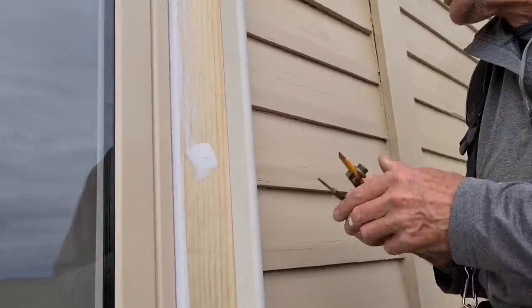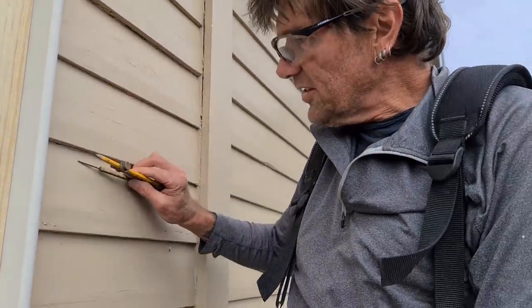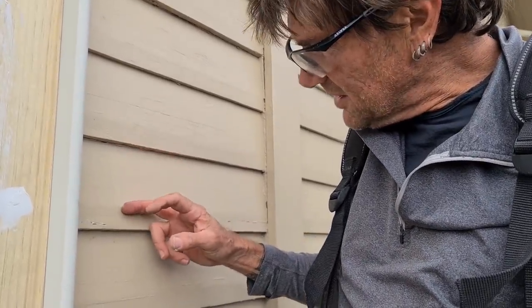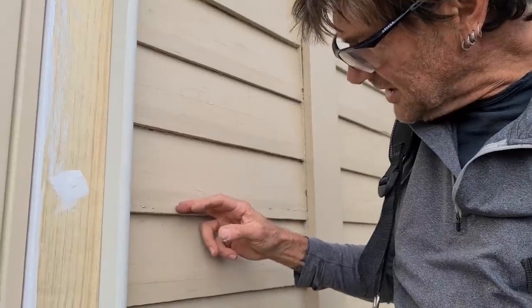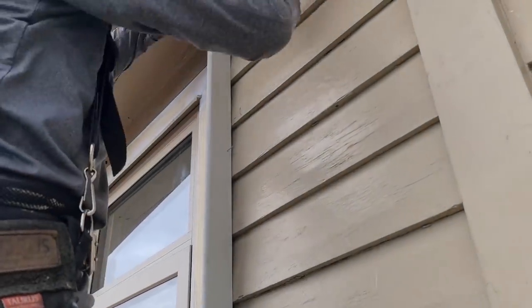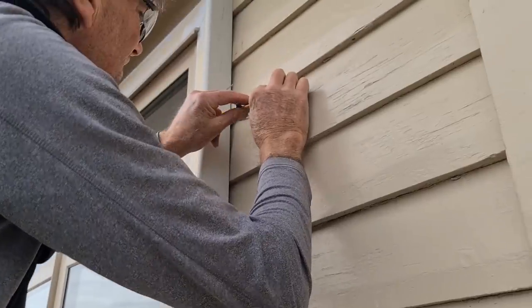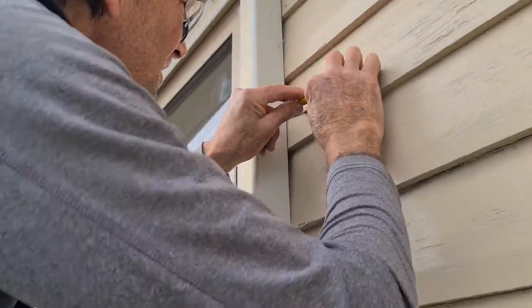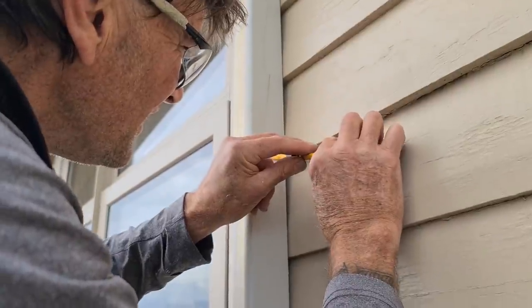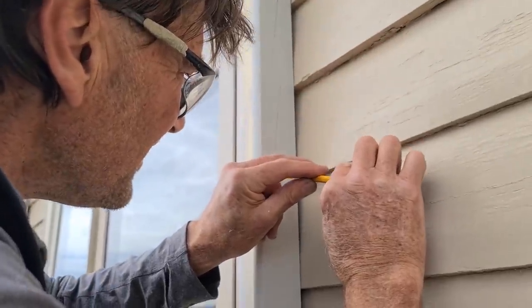I have to do this, and it's kind of interesting. You move around the other side and I'll swap sides with you. You might want to see this on the back side as well, but I can't just copy this like this. It doesn't work. So with this, all I'm going to get is this shape here. I'm going to get this down to here. Right. That's what I'll do first. So then what I do, I have to keep it level the whole time. I'm only trying to get this mating shape here. Okay. I've never seen a compass used like that, bro. That's great.